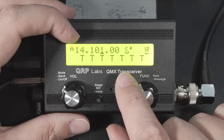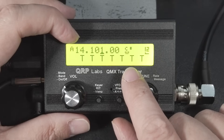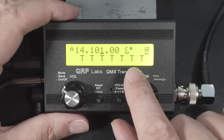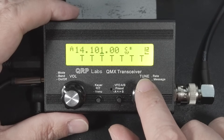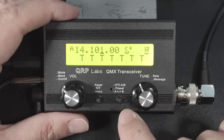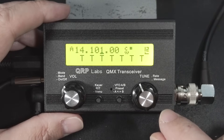Safe mode means your rig isn't going to transmit because of either high input voltage or high SWR. If safe mode comes on, just fix whatever the issue is, then go into the menu and back out again and it'll clear safe mode. To the right of that you have your mode — CW or digital, and eventually single sideband. You also have your S meter on the top and your SWR meter on the bottom, and your battery voltage, which is configurable as a number or a graphical battery icon. On the second line you have decoded text if the CW decoder is turned on, or VFO B frequency if running split, or the RIT offset if RIT is enabled. Unfortunately, the clock gets reset when you power the rig off — that's the other annoyance this rig has.